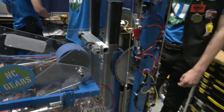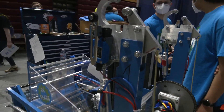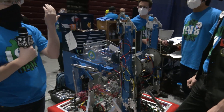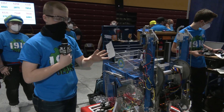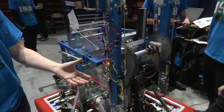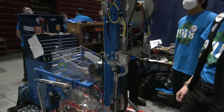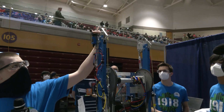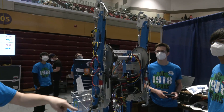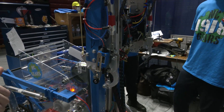One of the stars of your robot is definitely the climber — talk to me about what went into it. Was the current design your first concept, or were there earlier ideas that didn't make it? We had concepts where it would go up, click, a second hook would come up and click in, then fall back and pull in. But we realized there are different methods — the distance between the bars stays the same, so we used a gas spring or pneumatic cylinder to push it up. The limit switch tells us when we're good to go, we spin to hit the next bar, it releases the hooks, and we go up to traversal. We got the idea from car door hinges and working with other teams.